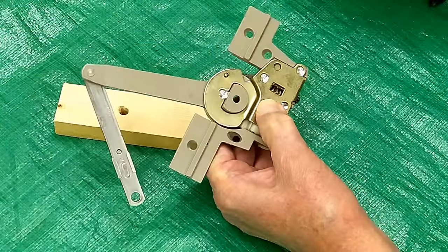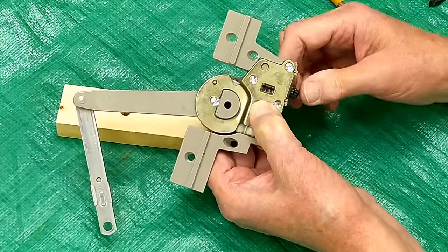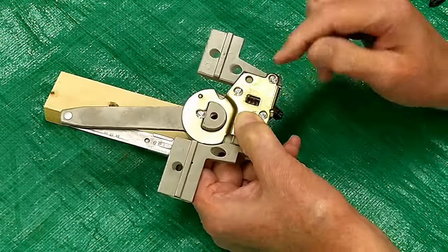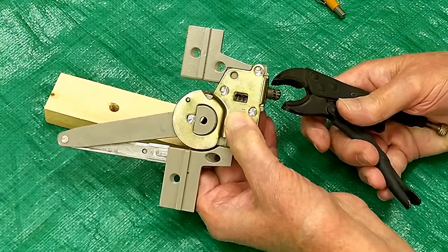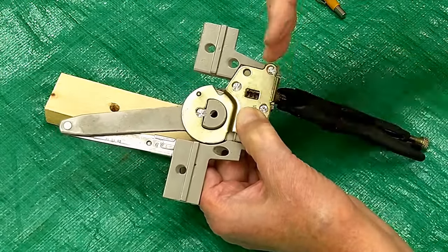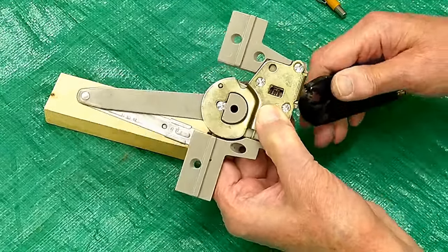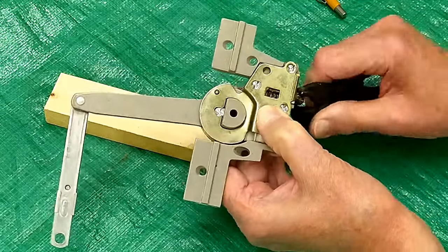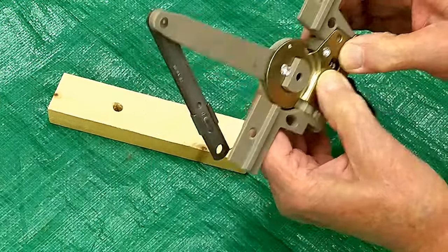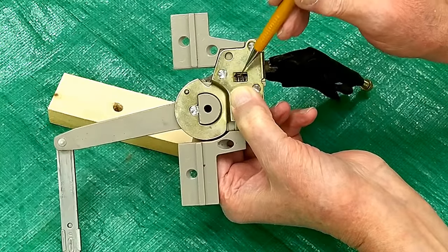If I hold this together we can see right in here. This shaft is on a gear that's operating that one — it's like a differential. We're translating rotation in this direction to rotation this way. And if I turn that, there's jumping, skipping. The teeth on this shaft are not fully engaging with this one.